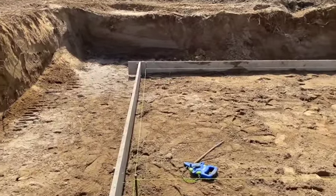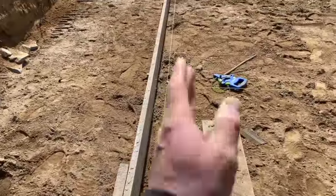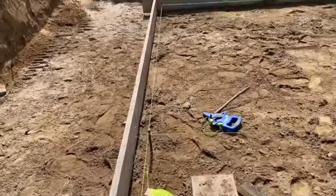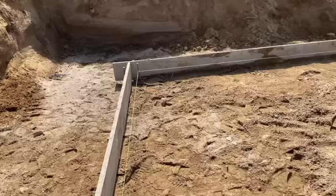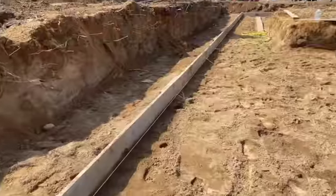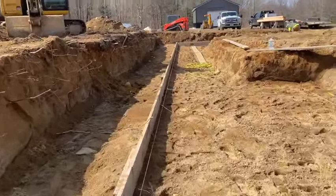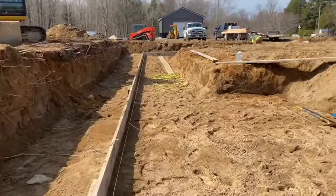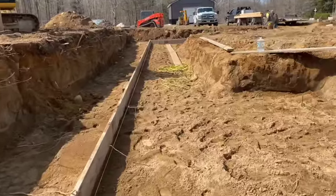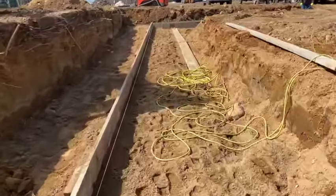They're not boards, but usually we use boards across these footers, but we're going to cast the wall and the footer, so we don't want to put wood in there. We did the wood in there a few times, but some parts of the country they can't have wood in the ground. We can here. We don't have any termites in New York State, but I figured out a better way to do it, so everybody can do this throughout the whole country. You can do these monopours.